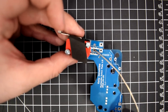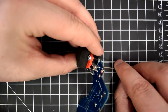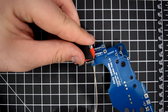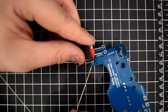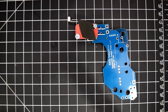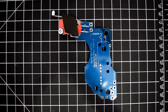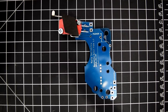Soldering this thing up is really easy. Next to all the little arms on your switches are tiny little holes — just take your wire, stick it through the hole, and solder the connection. One thing Adrian Kelly wanted me to explicitly note is that the hole at the bottom for the comm tab of the pusher switch should go on the inside of the tab so it doesn't mess with the main trigger. Overall, it's straightforward — no bunch of wires everywhere, no diagrams needed.